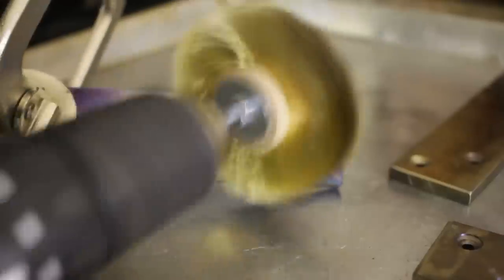I turned my oven back down to 400 degrees and that worked much better. Temperature makes a big difference. This piece I did at a lower temperature when the steel was just starting to become straw-colored, and this one got left in a little longer so the steel had already started to take on a blue-gray-black cast. The lower-temperature one is a bit brighter and shows off the brass better. They're a little inconsistent, so if I were to do it again, I might do fewer at a time — maybe only one or two pieces at a time in the oven — and then pull them out and quickly brush them.